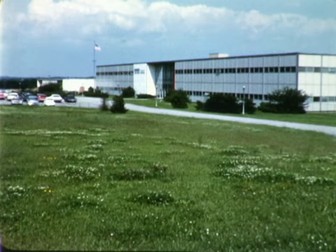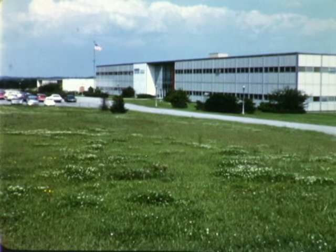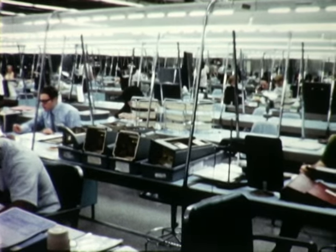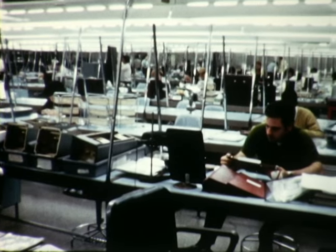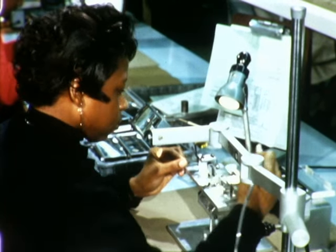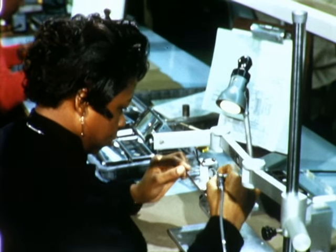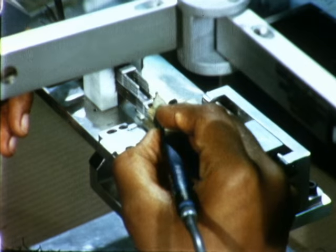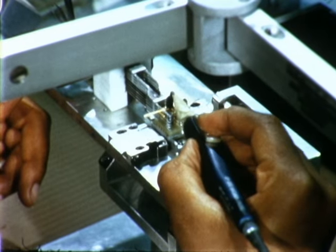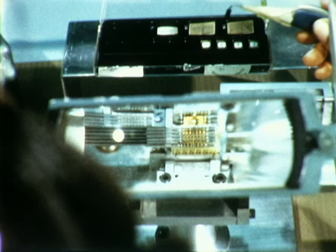The Norden Division of United Aircraft is the subcontractor for the F-111D integrated display set. Production of the IDS is underway at the Norden Assembly Area. CoreMods, the basic electronic packages on the IDS module boards, are here shown being assembled. CoreMods represent a unique method of stacking integrated circuits and discrete components to form individual electronic packages. The components are prearranged in the proper stacking order and are accurately positioned horizontally with the aid of a special alignment fixture.